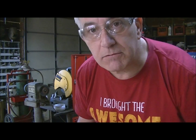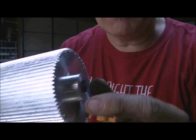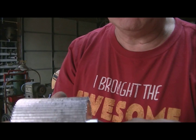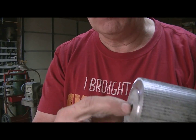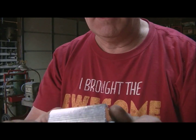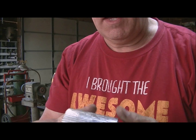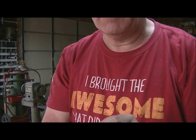We'll put that in another video later, so I'm not going to give it away. If you happen to know what this is, you can put it in the comments. Here's what it turned out like — you can see I have a little shoulder built on the first gear already. My hope is that I'll be able to turn this down on the lathe: I'll mount this end in the chuck, put the live center in this end, and then just part them off, leaving a shoulder on part of it. That's the plan — I haven't tried this before so we'll see.